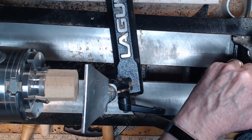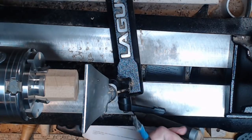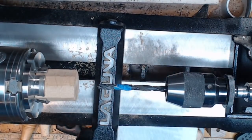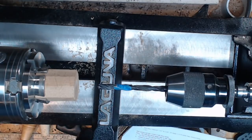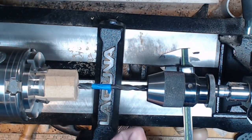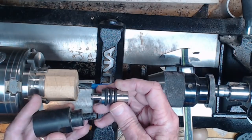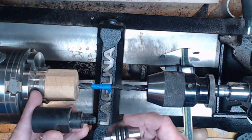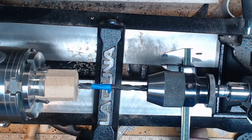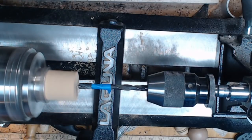Your experience may vary. We're using a 3/8 inch mandrel. The drill bit I'm using that works for me is 11/32nds, but you might use a 5/16th inch — some folks have used 21/64ths or 23/64ths, but 11/32nds is going to work for me. We're going to drill a hole just about 5/8 of an inch deep. The stud on our bottle stoppers is a half an inch, and the mandrel is 5/8 of an inch, so we'll drill just a shade deeper than 5/8 so this fits flush against the mandrel. We'll drill at about 500 to 1,000 RPM.